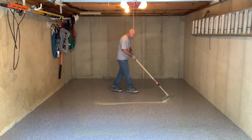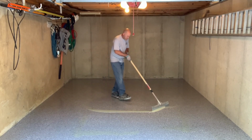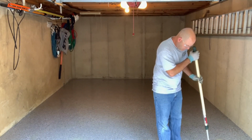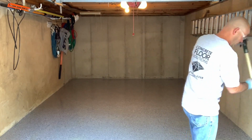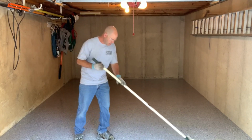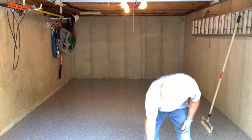It's inevitable. You're going to find insects in your epoxy. Don't ask me how they get in, but they do. I have a couple of crickets and a spider or two floating around in here. I'll pick them out at the end. And before you squeegee all this out, you want to make sure you wet your roller up in the puddle. I'm using an 18-inch roller. This absorbs about a 12 or 14-inch puddle, believe it or not. And don't forget your 6-inch edging roller.